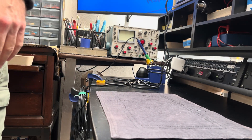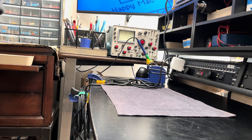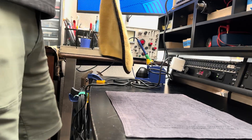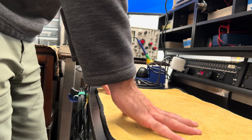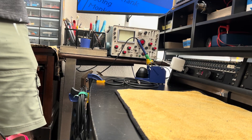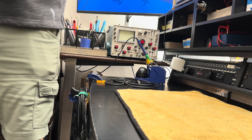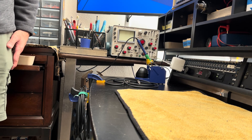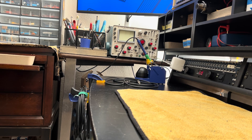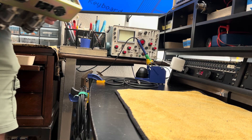We're going to get her topside down — upside down. Let me grab a towel of sufficient length so we don't scratch the heck out of my working surface. These are even difficult to troubleshoot on my isolated power supply, on my variac. If I'm not mistaken, I'm looking at a 10-amp fuse in this guy, and I can successfully power things up to 4 amps with my power supply. It's a little challenging, but not impossible.